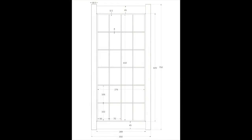So this is the shoji we'll be making. As I mentioned in the introductory video, it's a scaled down version of the first shoji in Book 1, The Basics. All the joinery though is full size. You can see that it has 3 vertical and 5 horizontal kumiko, and all kumiko are evenly spaced.